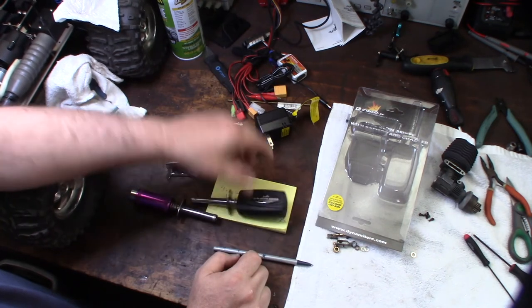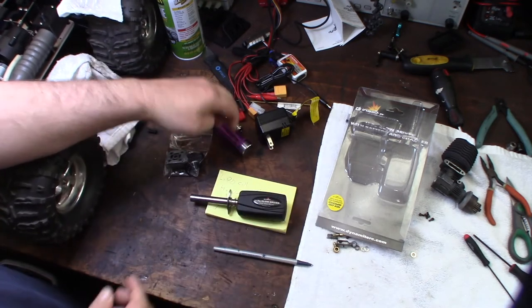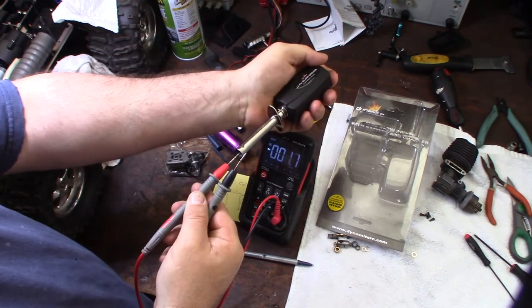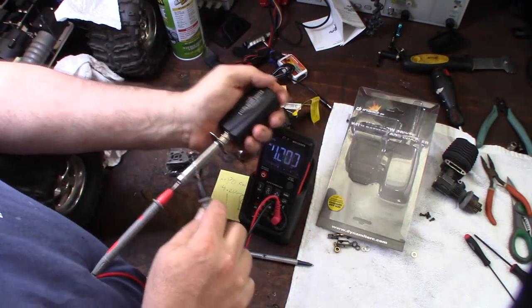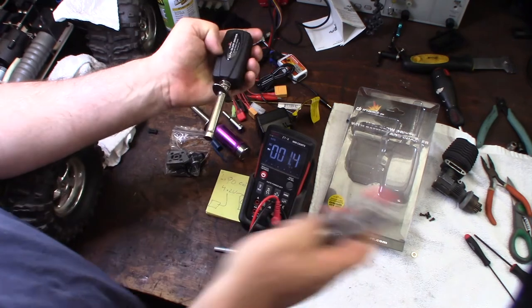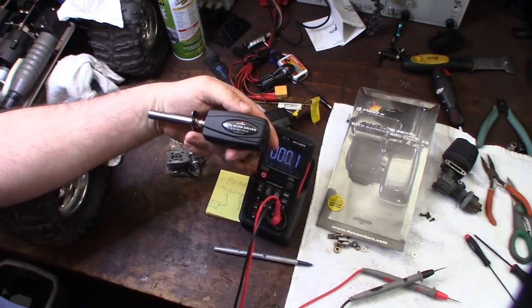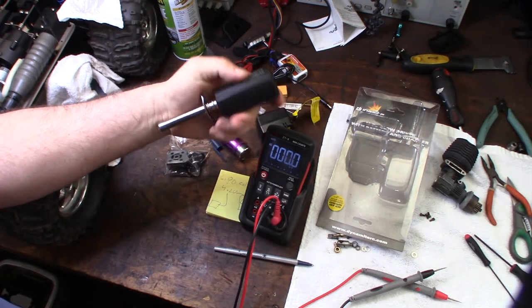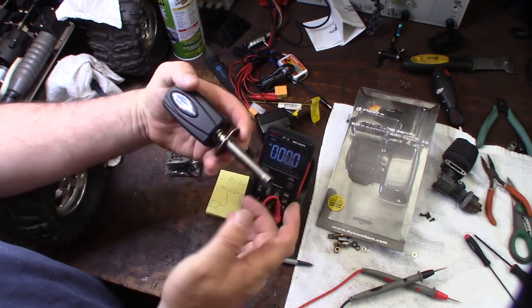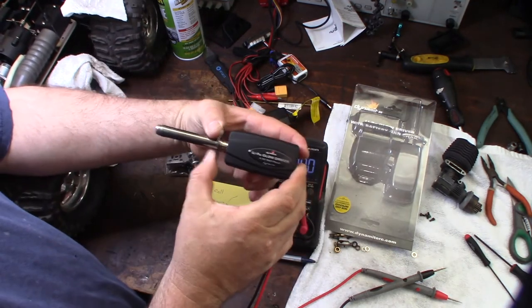It's putting out 4.4 watts, which is definitely a lot more powerful than the old NiMH cells. Let me get my multimeter. Positive in the center, negative on the outside — I'm getting 4.2 volts. So if you're sending higher voltage, you have to send less current. That's weird; I would have thought the opposite. I've had other glow plug igniters that stepped it down to 1.2 volts, so possibly you could front-charge this thing. At this point I'm just troubleshooting — this was all just a guess.